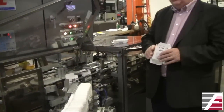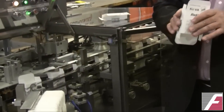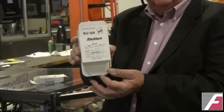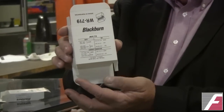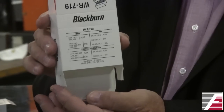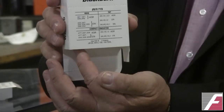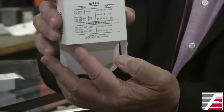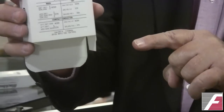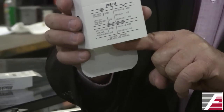The next step, once the carton is in the pocket and squared up, we need to close the bottom flaps. We have two minor flaps and one major flap. The trailing minor flap needs a mechanical kicker which will come forward and kick that flap up into the closed position. The leading minor flap will have a guide that, as the carton moves past, gets pushed closed.